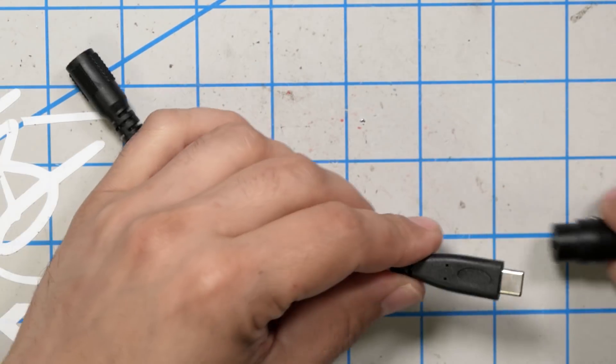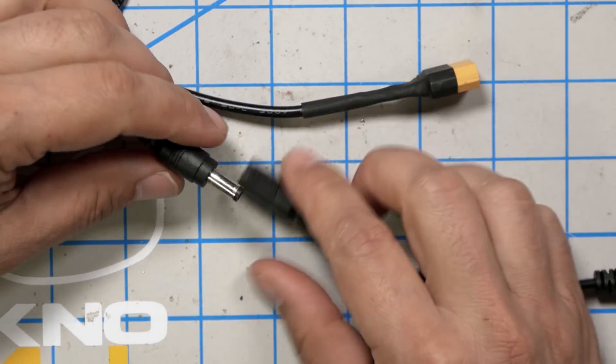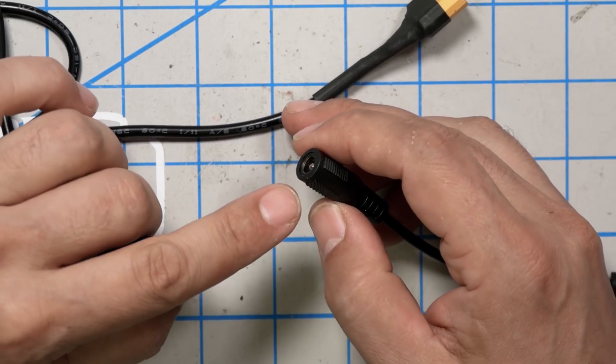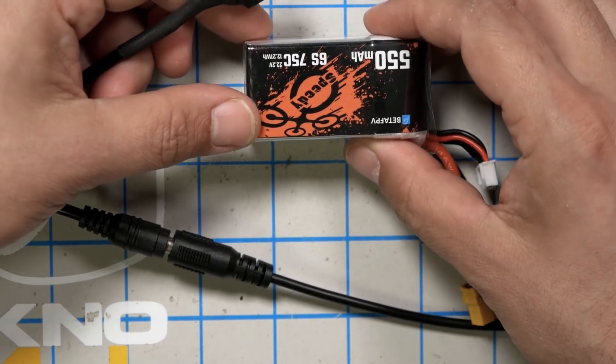We're going to set aside the cheaper one, but don't forget it exists because somebody out there needs that $5. The D60 is powered via USB-C. You can power it from a high-powered USB power bank — not just a little 500 milliamp power bank. Or it comes with an adapter with a barrel plug, and it comes with an XT60 to barrel adapter, so you have your choice of exactly how you're going to power it. You could use the barrel adapter from a wall wart — you're going to need like a 60 or 80-watt wall wart — or you could plug it into an XT60 and plug it into a battery. You can use as little as a 3S battery and up to a 6S battery.